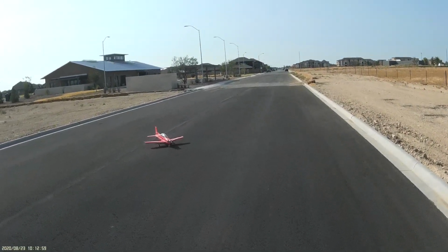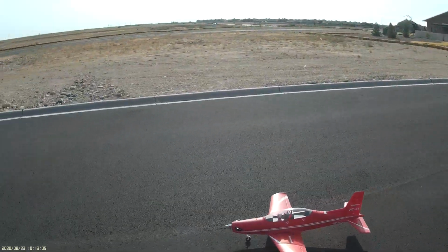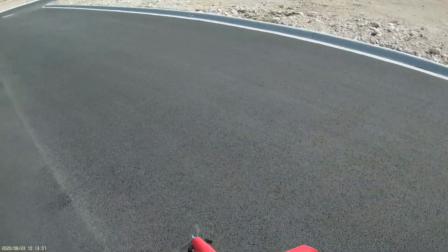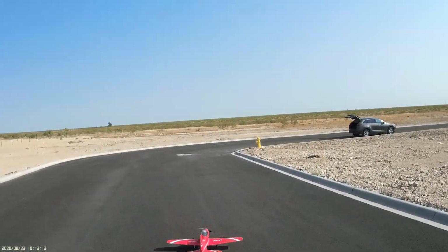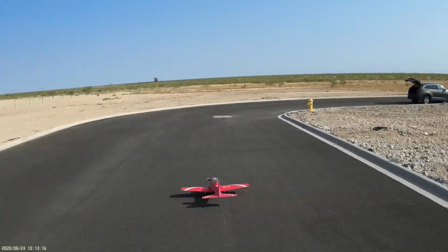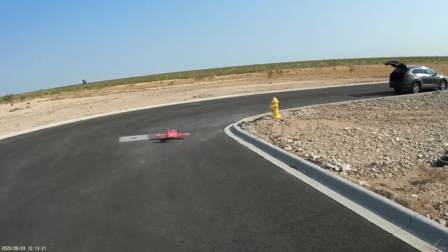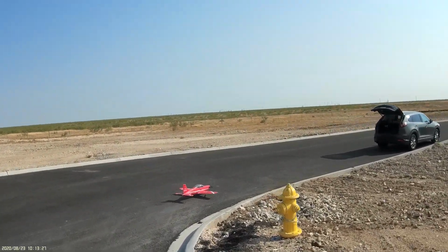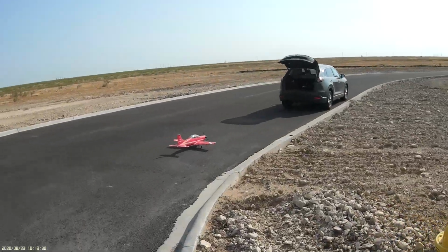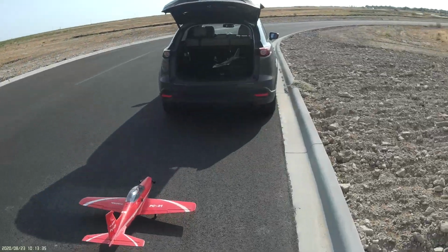And I think that's a big part of why my speed control is getting warm today. Because I am cruising around half throttle, and when the power's on half the time and off half the time, pulsing on off, on off, what I've read is that is kind of the worst case scenario for your speed control as far as heat is concerned. That's what makes it generate more heat. Because of that switching. And I don't know that for sure. It makes sense, but I'm no electrician.